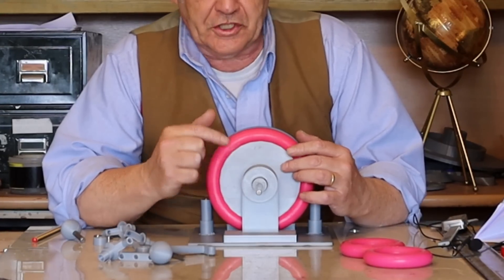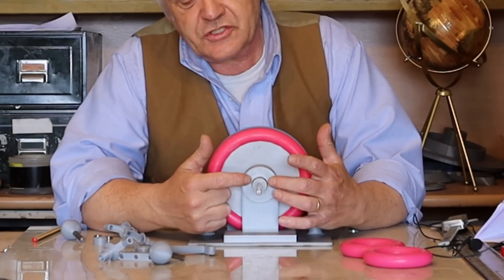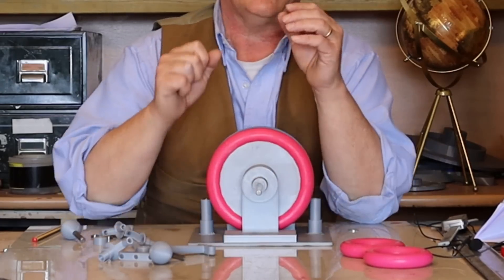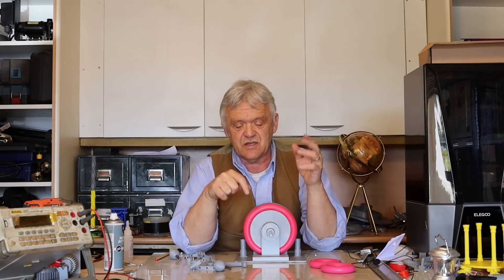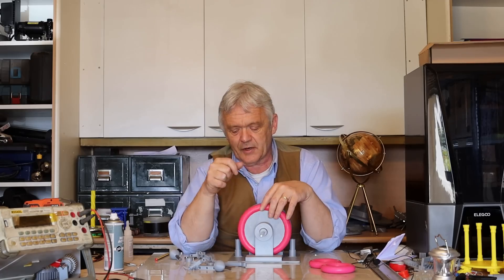On this, we put a washer between the ring and the bearing, then another washer, and then there's this stop here. So it's caught between two washers. Those washers press on the inner race and make sure that the bearing turns really nicely. That plastic stop has a bit of glue on it to hold it in place.